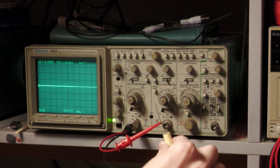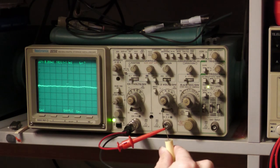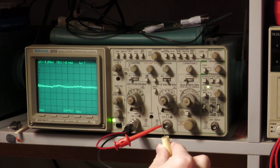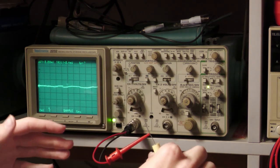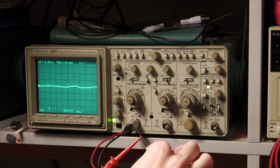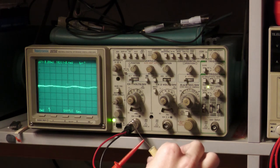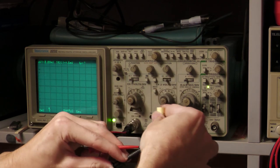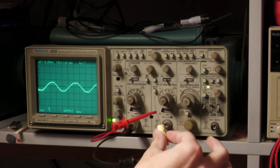When I touch the body there's not much happening. I increase the resolution and get a little bit of signal — we're in the 2 millivolt range and not getting much. I can also turn on the bandwidth limitation if my oscilloscope has it, since most of the interference will be 50Hz. This filters out high-frequency content — the cutoff is about 20MHz on my scope — but still I don't see much. So next I'll reverse the capacitor.